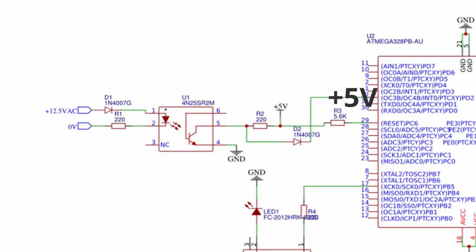See what we have here? If we set up the Atmega chip to trigger an interrupt every time it detects a logical change here, we have successfully created a zero crossing detector for our circuit. I will talk about the code I have inside the Atmega chip in more detail in the next video.